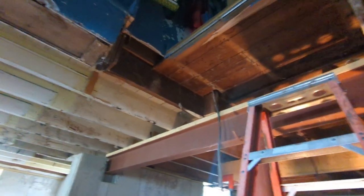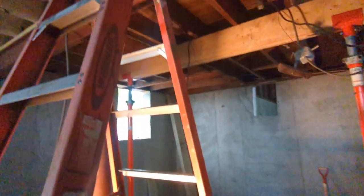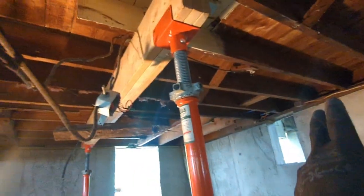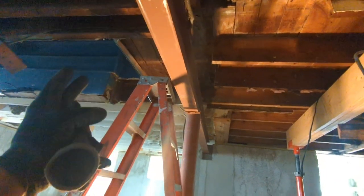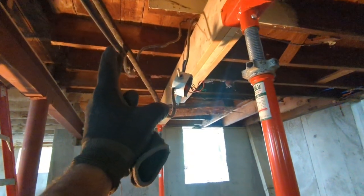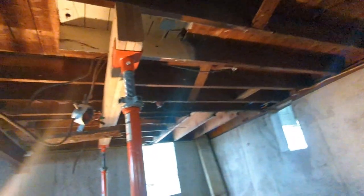I don't want to commit to cutting the landing back any more than it ever was right now, and I won't miss a little bit of lumber if I cut it off later. So I'm going to go get three 2x8 sticks. From there to the outside wall is about maybe 12, 13 feet, and it's nice to have 2/3 of the length. So I'm going to just go with 10 footers. They'll slide out from their start here, and wherever they peter out down there will be fine. This one will be slid even further. I might get two 10s and an 8, because that's probably easiest. Two 10s and an 8.